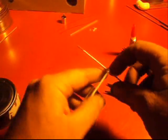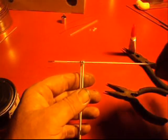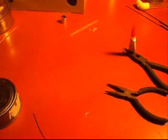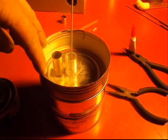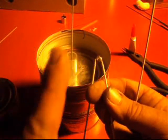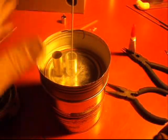I need to do the same thing with this other one. It's going to spin especially once I get the paint off it. When I look at this I see it's kind of binding when I try to twist — you've got to sit there and make sure it's going to spin when it's straight in the direction you want it to go. Get all your bends done first, then come down here and clip these off even and put a 90-degree bend on the bottom. That goes into the edges over here and gets glued down and against the sides — that'll make it very strong. Do one for the other side, then bend the crank and put that in. We're not going to glue the second one in yet because the crank is bent and you'll have to thread it through the hole, play around to get it in. Once you've finally got it in, glue everything in, set it all up, put the linkage on, and we'll fire this thing up for you.